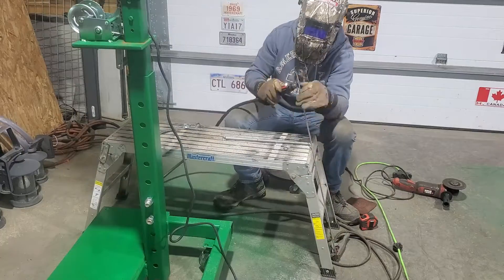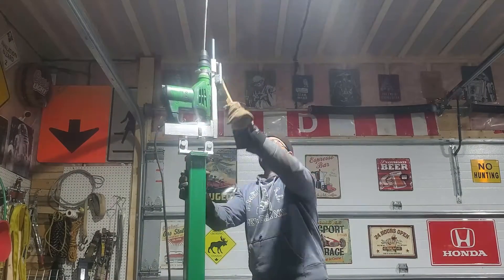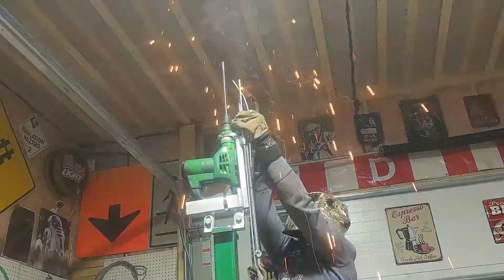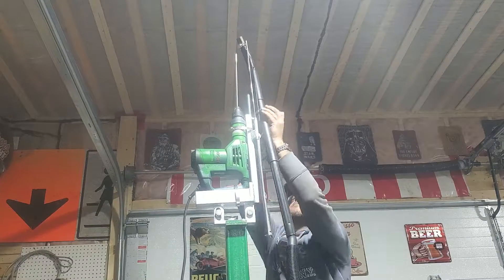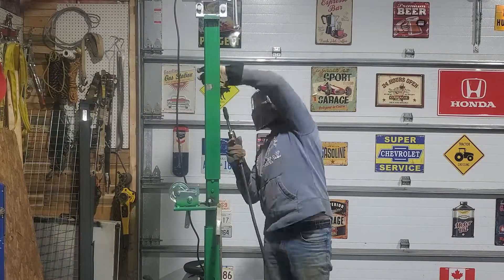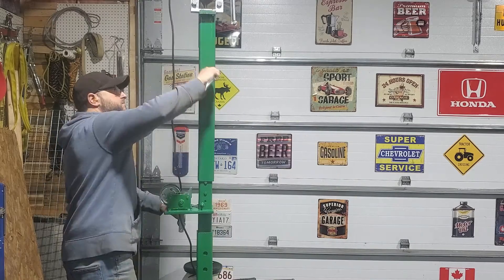Now I'm adding a sliding rod to hold the vacuum hose and nozzle. This is going to be spring-loaded so that it stays up near the ceiling but is able to retract as the drill moves upward. I'm using a piece of flat bar to hold the vacuum nozzle straight and clamp it in place. One of my biggest worries using wire rope and pulleys for this lifting device is having the cable come off, so I needed a way to keep constant pressure on the mechanism to keep the cable tight in the pulleys. To achieve this, I added two fairly strong springs to the assembly to help hold the top section tight and help it retract as the crank is released.